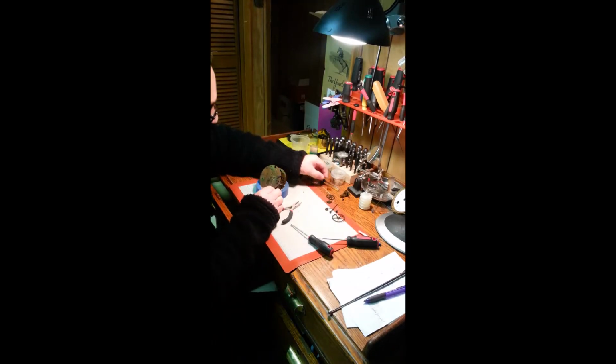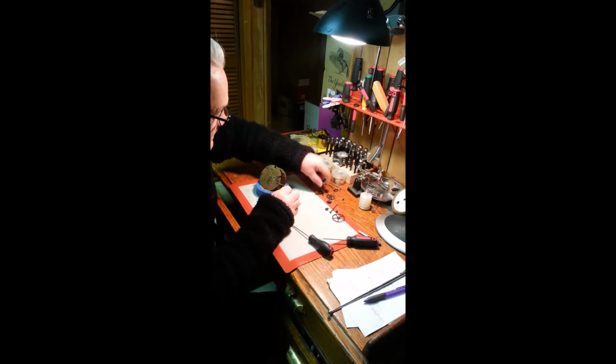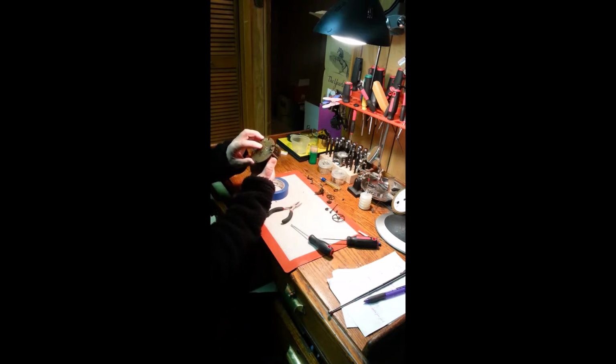Okay, and the back cock holds the escapement and the verge, and that comes out automatically when you remove the back cock. So next thing I got to do is straighten out that suspension spring, if it's worth keeping or not. But that's where we are for now, and now that everything is off, I don't think I need to remove these cocks on the back, so what I'll do now is start on the front.